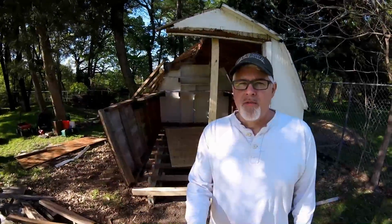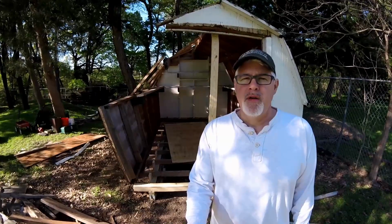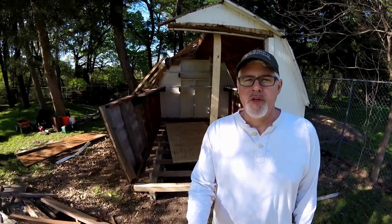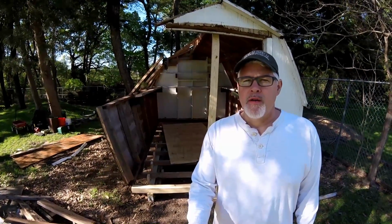Yesterday got through the foundation piece, which I think is the most important kind of building upon. Redid some of the flooring, the joists, put new boards in, treated wood, raised the building about 4 inches, leveled it, squared it.